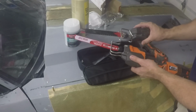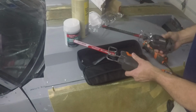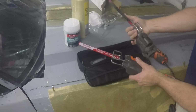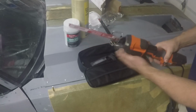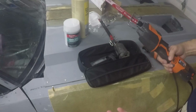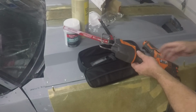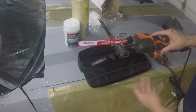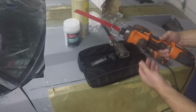Yeah, it's got a higher tooth count. Yeah, and it's a thinner, bendier blade. So if you need to cut and bend the blade while cutting, it will let you do that. So it's really nice for cutting foam and things like that. But for cutting the actual fiberglass, this one you can't beat. It lasts forever. I think I've only bought a couple of them, really, 3 or 4 maybe, and it's really good. So I recommend that blade for cutting fiberglass for sure. It's really fast. It doesn't get hot, and it just lasts a long time.